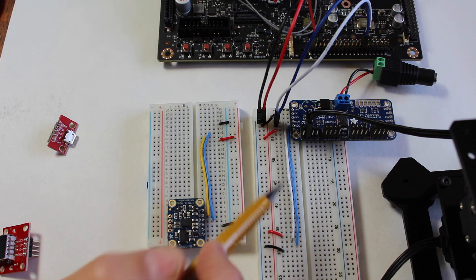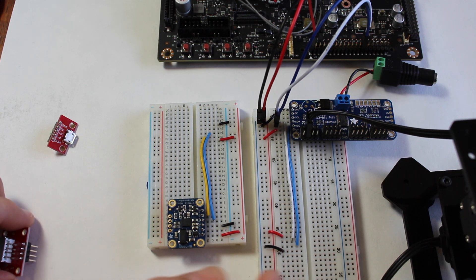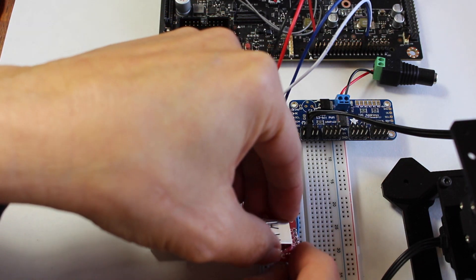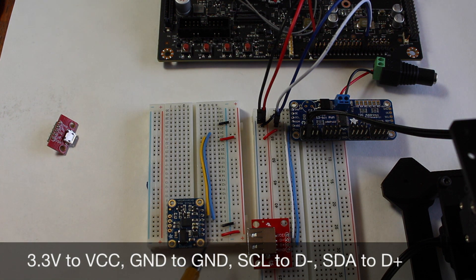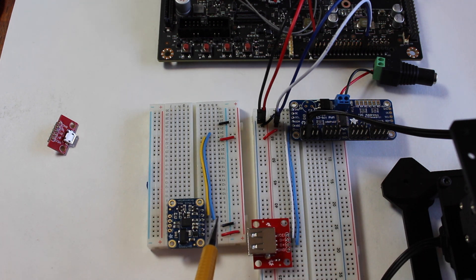We then take those signals and run them down the board here. We bring power and ground across because we're going to do something nearly magical — we're going to put a USB connector here and use this as a place to bring a signal over to our IMU board. The IMU board is wired similarly. There's basically a power and ground rail, and the SDA is on this blue wire and SCL is on this yellow wire.